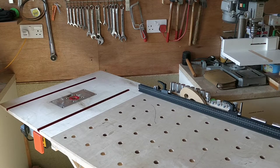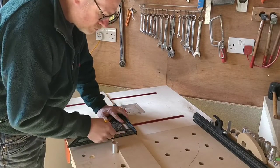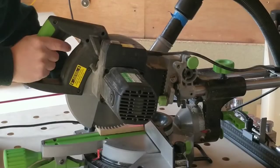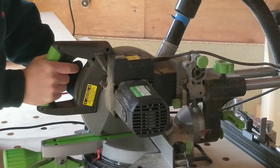I'm going to try and make a feather board using some MDF. Using a scrap piece of 9mm MDF, I marked out a piece the same width as the router table and drew a guideline about two inches from the side. I then tidied up the end before cutting the board to length.